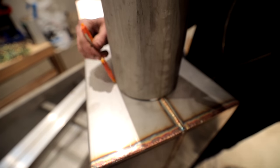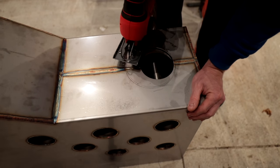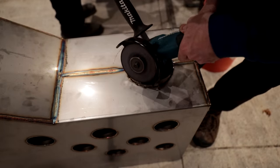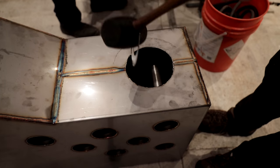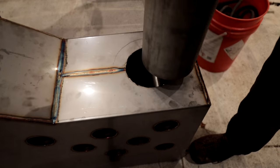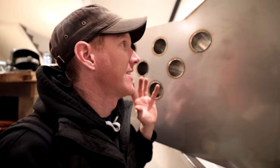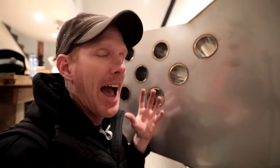Normally these snorkel type stoves are always made out of aluminum, and the reason why is because they ship them all over the world and they want to make them light for shipping. Not to mention aluminum has 15 times better heat dissipation than stainless steel. Although if you make it out of aluminum, you have a better chance of corrosion over time. And longevity wise, if you're gonna build it once and have it for life, you build it out of stainless steel. Now, what we did in order to compensate for our heat exchange loss is we added more tube.